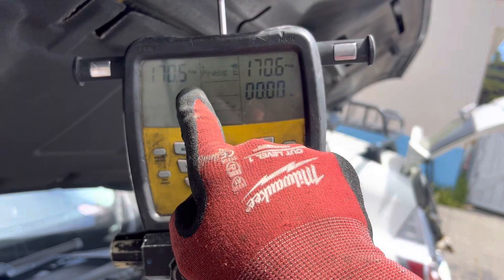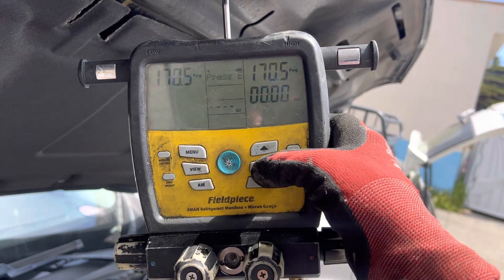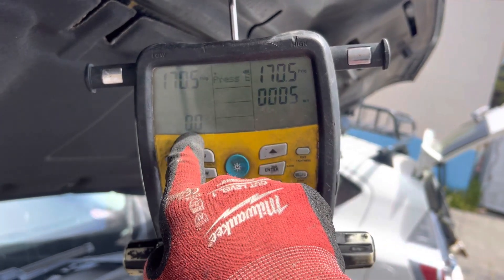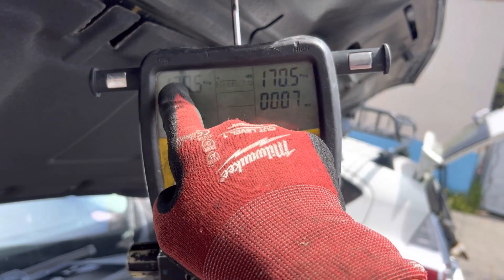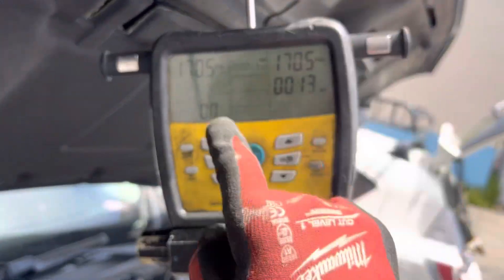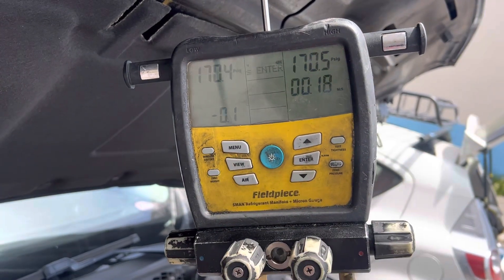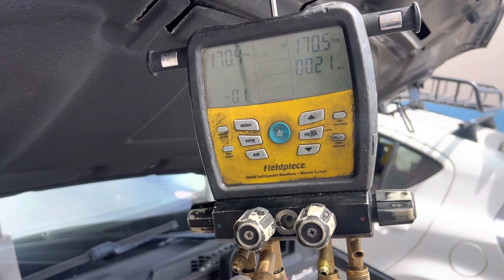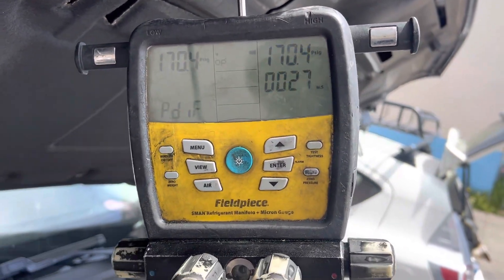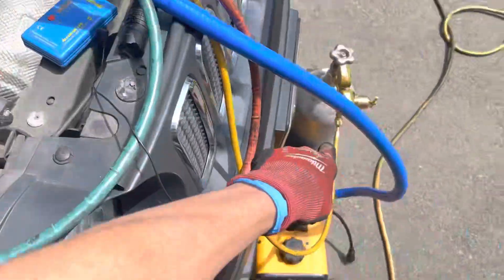I'll press Enter and you'll see the timer turn on. Right now it's timing — one second, two second, three, four — like that. And over here it will display from your start pressure, as tenths of a PSI go down — in some cases go up. You can see 0.0 there, and there's 0.01 loss. Now remember, I did not let this rest 10 or 15 minutes first before starting this test.